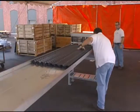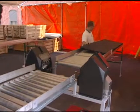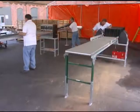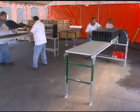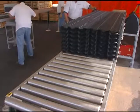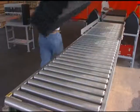With a crew of 4 to 5 people, a conservative output of 300 cubic feet per hour or 8.5 cubic meters per hour can be expected when assembling 24-inch deep packs, and 180 cubic feet per hour or 5.1 cubic meters per hour when assembling 12-inch deep packs. These rates are based on 72-inch long sheets. However, we've seen motivated teams produce at rates up to 30% higher than this. There are many site-specific conditions that can affect the assembly rate.